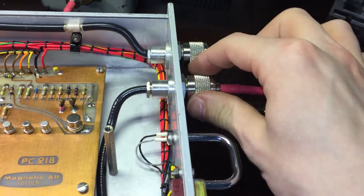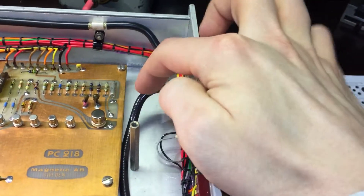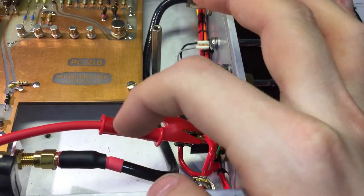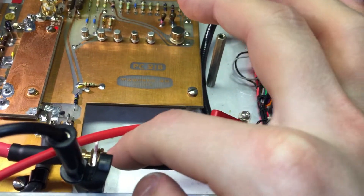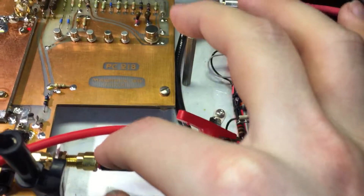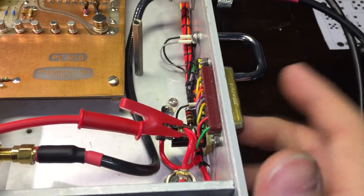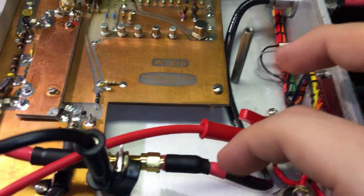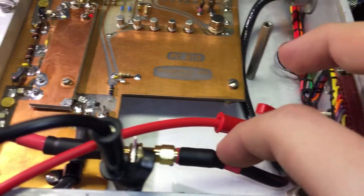The input here is an N connector. It goes through an RG223 cable. I've added something here where I'm feeding power in right now because the fuse holder is missing the front part. Normally this was one piece of coax — I'll explain later why I've done this.